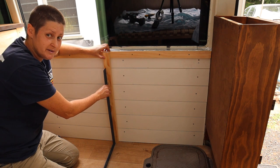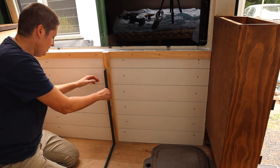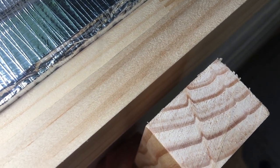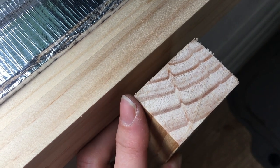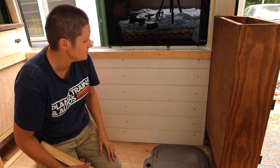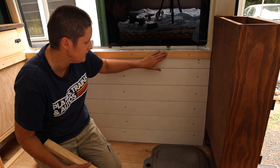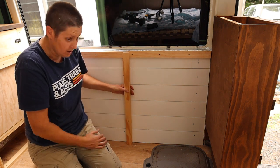Even with the 19mm piece at the top, it's still not quite square. Measuring the gap, it's actually about 9mm that I still need to add. I think I've got some 9mm ply in the shed, so I'm going to cut a strip of it to fit over that, which should bring the top of the studs out just the right distance so they're square to the floor.